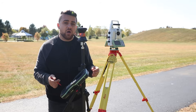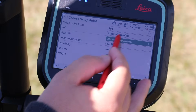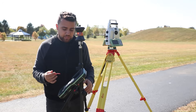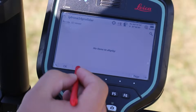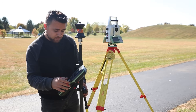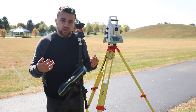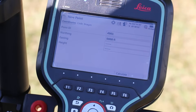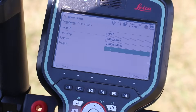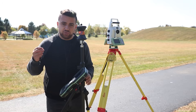Because I don't have a known back sight, I'm going to define the back sight along with setting the orientation all the way down on the last point. The point ID for our setup — we are going to define the point at which the total station is set up on, which is T4901. For my northing coordinate I'm going to assume 5,000, for the easting 10,000, and for elevation I'm going to assume 100. All of our units will be in international feet; for metric users, I will have everything converted at the end of the video.